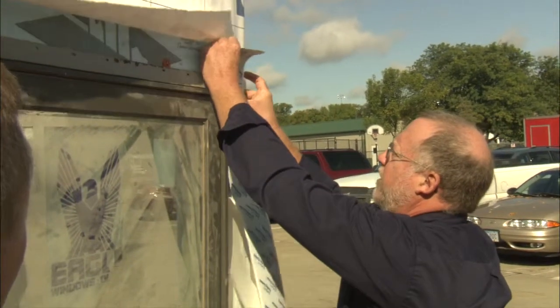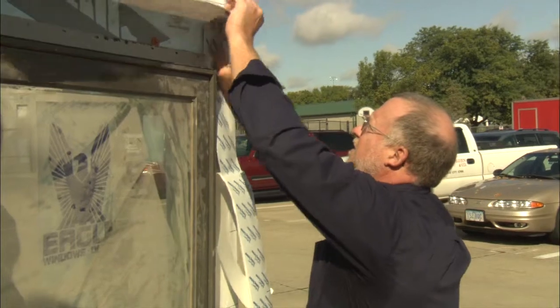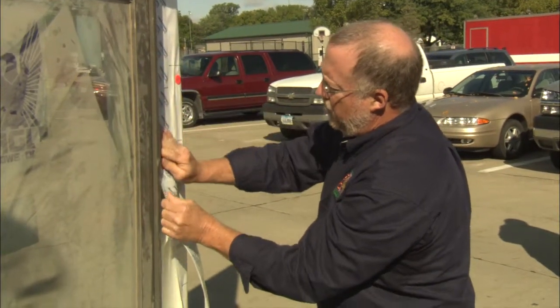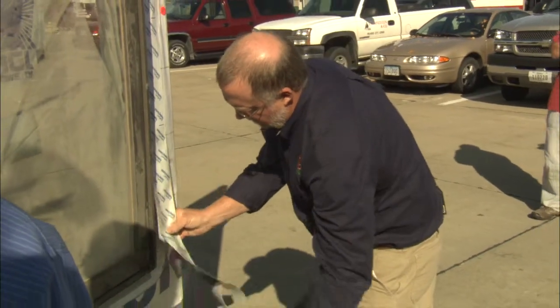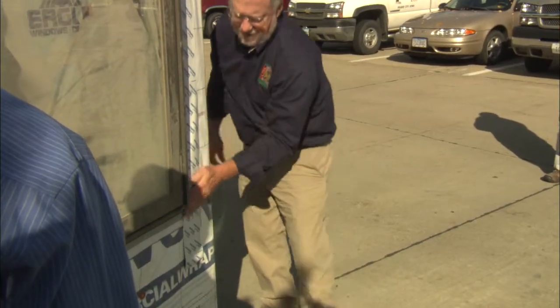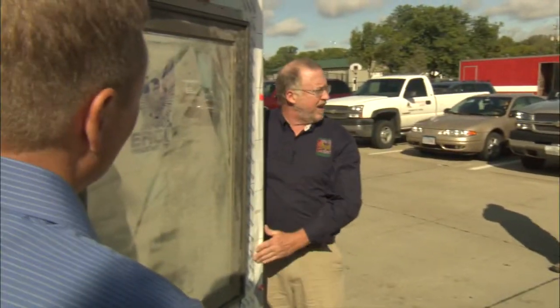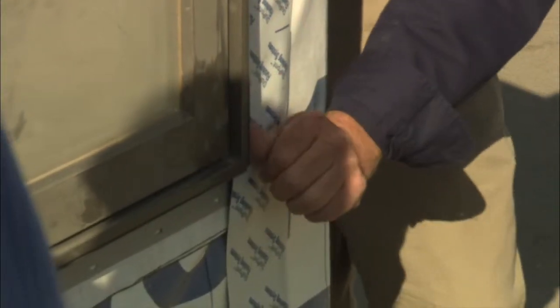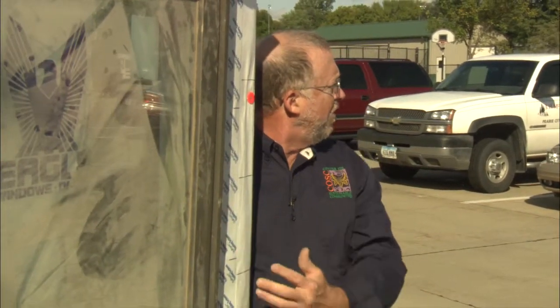The key to this is they want you to at least go four to six inches past the flashing and just run this right down the window. If you just butt it up against that nail flange like it's shown in a lot of magazines, and that nail flange has got a little hole right here — you really didn't accomplish much, but it looks like you followed the code. You want to roll it around the side; go over about a quarter of an inch and cover the nail flange so it's sealed actually to the window unit and holds that water out.